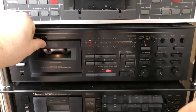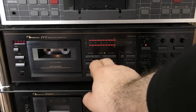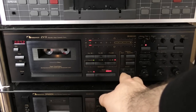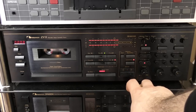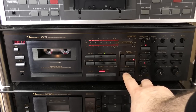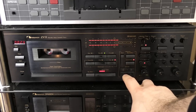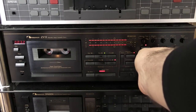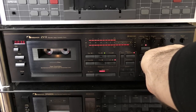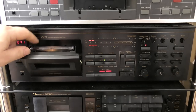Even though it was different through frequency sweep, like I say, let's just see real world what the difference is. Okay, the azimuth is the same. Now you see, this needs less level. The 88D needs less level and a lot less bias. Grief, that's a lot different, isn't it? So, let's bias this one up. That's the 88D, that's a very good performer, that nice and steady. Great version of the D, the 88.